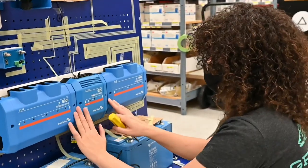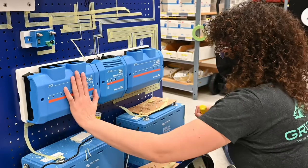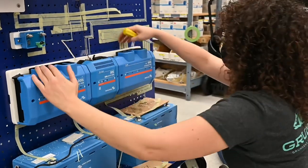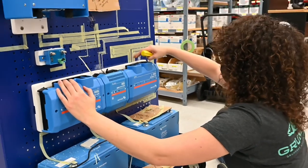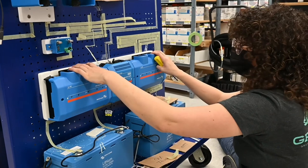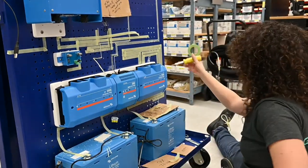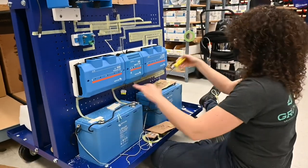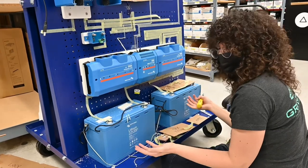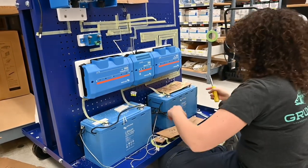These distributors are connected to the battery management system. They're like giant bus bars on the inside with mega fuses. The battery cables are going to connect in here, and then there are these big metal plates that connect these, and then the battery cables come out on top. We made it upside down so that the cable run out of the distributor and into the charger would be shortest. We made the battery cables extra length because for both batteries they have to be the same length in order to draw power evenly.